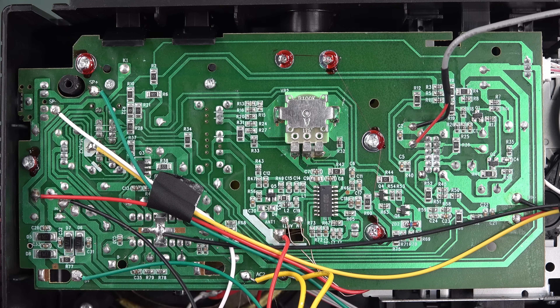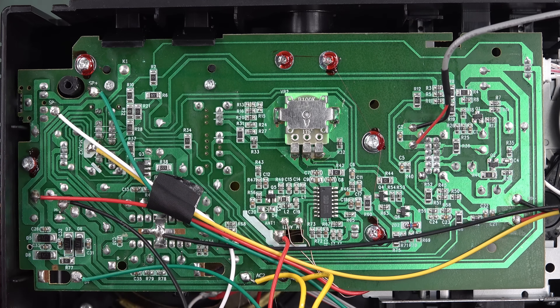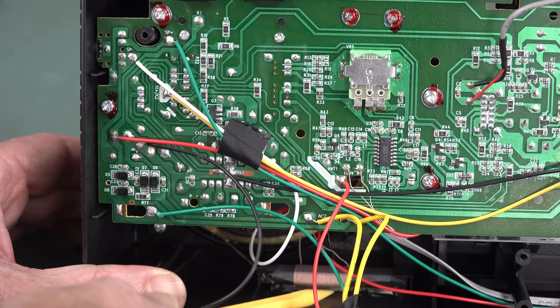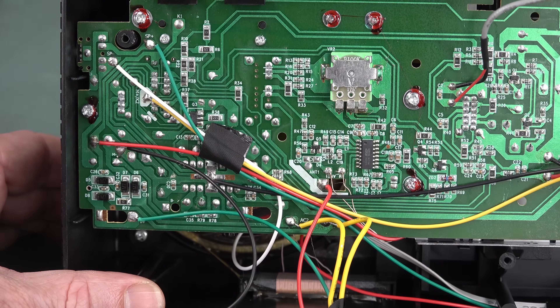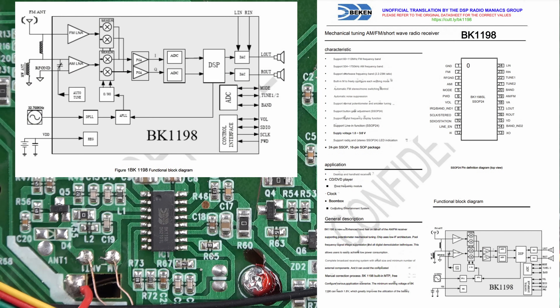A big difference from the 1980s — you don't get any film resistors. There's a bunch of surface mount. What's that chip down there? That'd be the tuner — yes, I can see the rod antenna connection, fine wires soldered onto there. So that's gotta be one of these all-in-one jobbies — and that's a BK1198 3-in-1 AM/FM shortwave receiver chip in there, just mounted on the bottom.